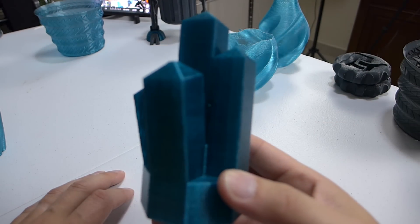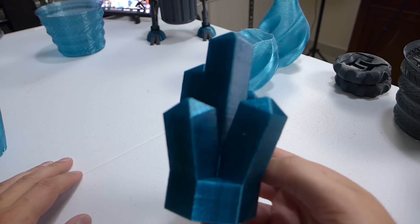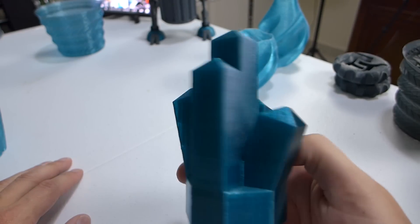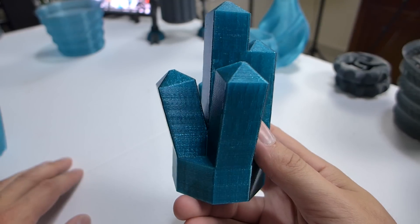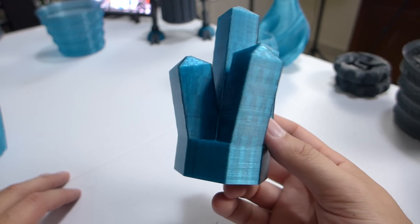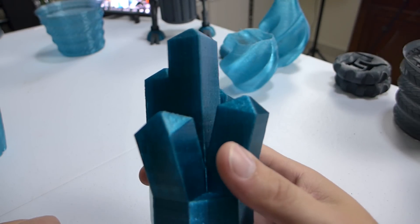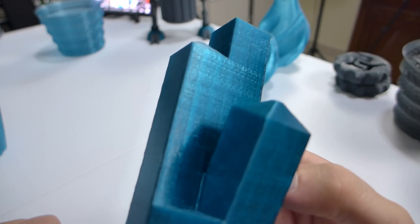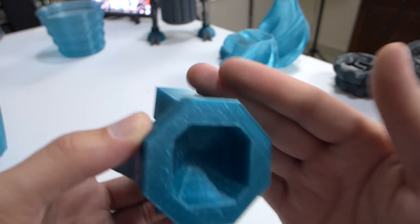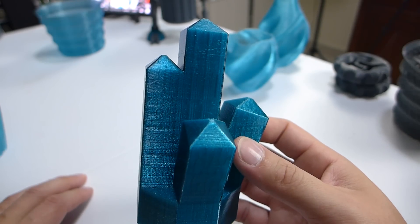To print something a little different and cooler looking, I printed out this giant Lego crystal formation. This is actually a great big Lego piece scaled up — I think 500% or 400% scale of the actual Lego brick. I would love to do this in vase mode or just two or three perimeters. To make this into a nightlight, I wonder if someone could angle that flat part up a little bit to make it more printable in vase mode and put a little light underneath — I think that would look cool. This was on the Anycubic i3 Mega. Really good layer resolution. Two walls, four tops, four bottoms, 20% infill — you can see the honeycomb infill in there. This printed very, very well and came out very clean. Very long print though — I think this took almost 30 hours.